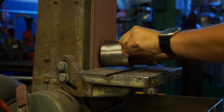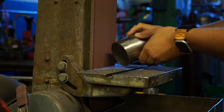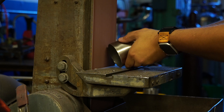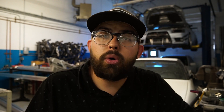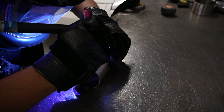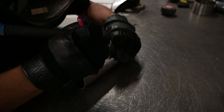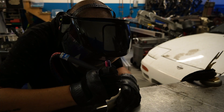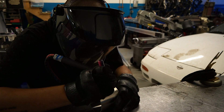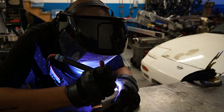At the weld bench, I cut up two pieces of 304 stainless steel tube. We're going to do one coupon with a purge and one without, so I can show you what carbide precipitation looks like versus what a good purge looks like. I also want to explain CFH per part size, and what leaky joints can do — if they cross-blow through the joint, they can remove your argon coverage on the outside of the part from your cup because your purge is too high or the joint is just leaking and blowing out your argon.